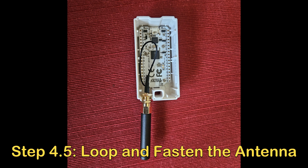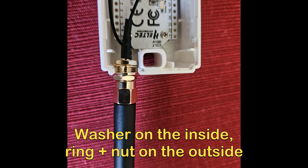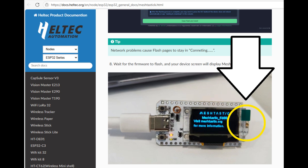Once the board is nice and snug, go ahead and screw on the actual antenna. Because nothing's powered, we don't have to screw on the antenna right away — we just have to make sure the antenna cable is plugged in. This is extremely important: do not, under any circumstances, plug the battery into the board before plugging in the antenna. A lot of people will freak out saying that causes battery issues and fries the board.